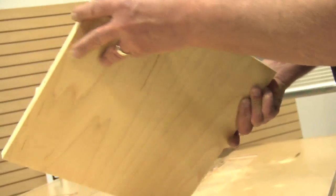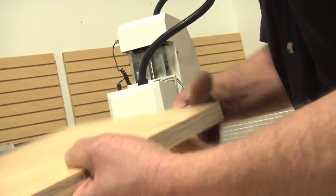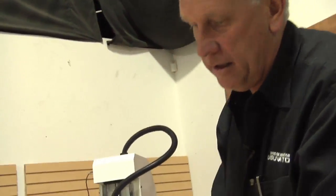These look pretty good. The edge finish is excellent — that compression bit does a great job and the machine rigidity is the key to all of that. There's no chatter.